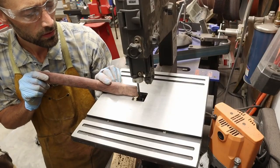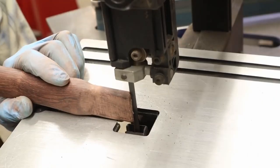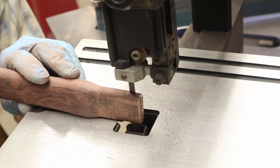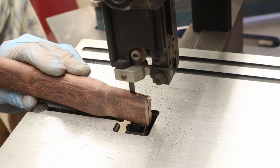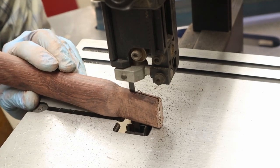This is a very no-brainer way of building a handle for anything in your shop. To keep the handle on, you're going to want to cut a groove in the portion of the handle that goes through the hammerhead, and you'll see later why this groove is so important to keeping the handle on.